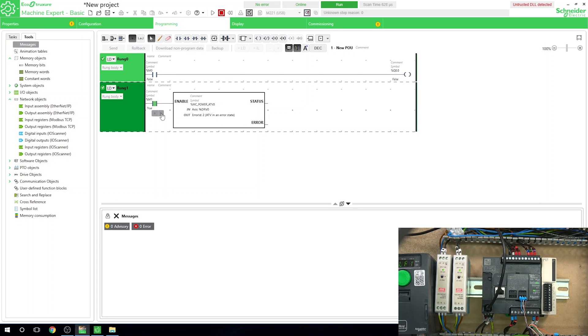As you can see, the ATV is in an error state — error 2, something is not right. Actually this time it's the drive that's in error, not a communications error, which is interesting. Either way, we're going to restart the system. If you do have a communications error, definitely restart your system and then try again. If you still have a communications error after that, then something has been done wrong. The system boots up and the drive is now in a ready state.